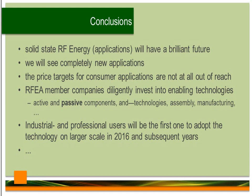Okay, next question is back to Anaren. How much power does the Zinger 40dB handle with high reflective power from the load? I think I mentioned a little bit about that. It's designed to handle the 300 watt forward, as you saw in the PA example, and that's the main building blocks we're working with in the Alliance at the moment. So 300 watt forward and full reflection back, so 600 watt total power. And the power handling requirement is quite high, because the power you might see on a localized level, the peak, can be much higher than just the forward and the reverse combined. It can actually be quite a bit higher locally. So it's designed to handle 300 watt out and 300 watt reflected.